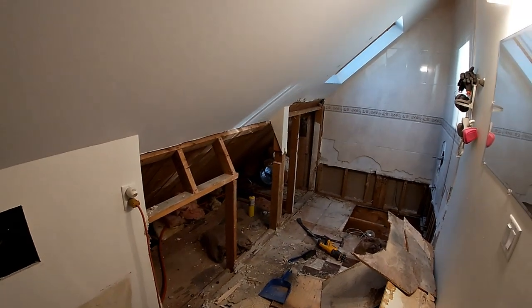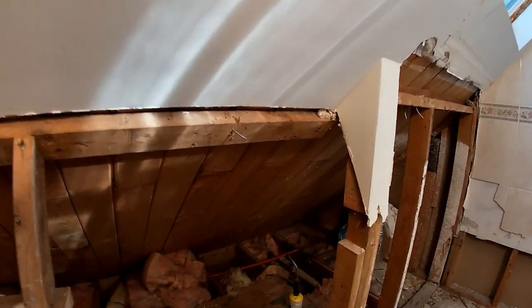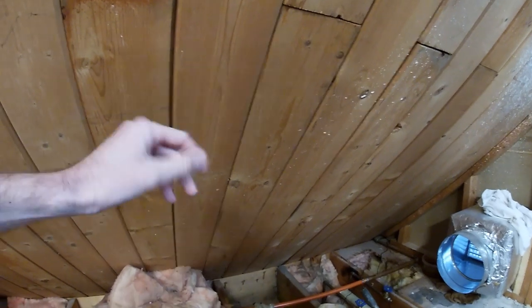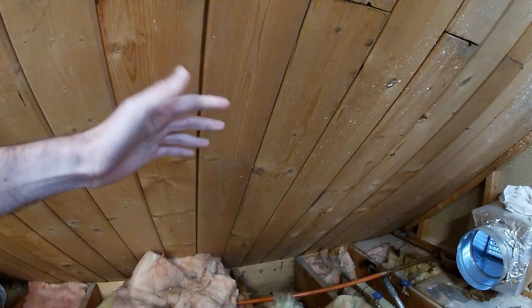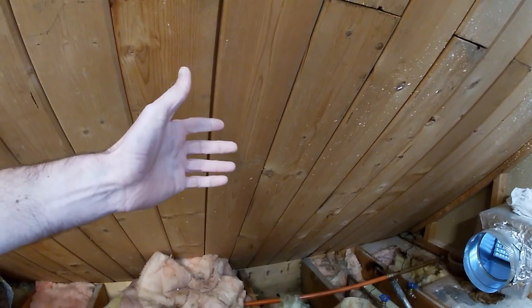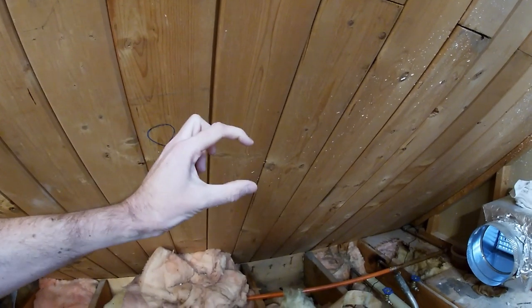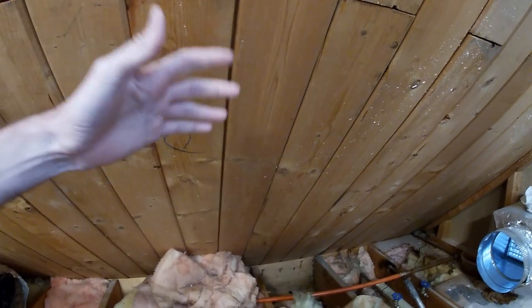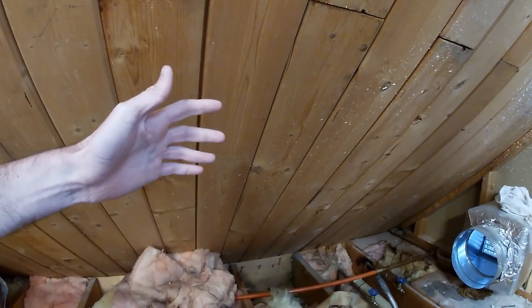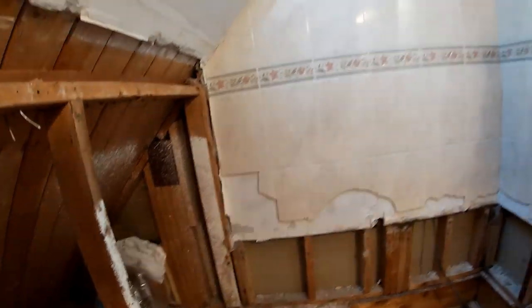Typical construction. I've got a very unique house, and the roof, what you see here, which is the finished portion of the roof inside the house, this is actually also the structure. So this shiplap style look to it is actually about 1¾ inches thick, if you can believe it or not. It's really meaty stuff, and this provides the actual structure of the roof. Now obviously this can only go so far as a span goes, so throughout the house there is some sort of bracing that supports it.